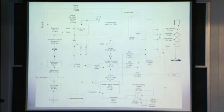Yeah, a couple. What you just said, is there a way that you could do a two-stage cooling? Essentially use process heat to remove it to a certain temperature, that way you don't have to suck all that. Just a bunch of loop condensers. It's usually done in three stages. The amount of temperature drop that we're dealing with is usually done in three stages. Okay. So that's what we're planning on doing. We just don't have all the components necessary to put it in. But the first stage is we are using process heat. That's a really big drop from about 700 Celsius to 100 degrees Celsius. Okay. All right.